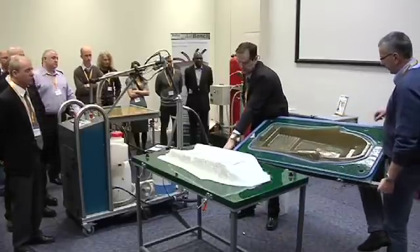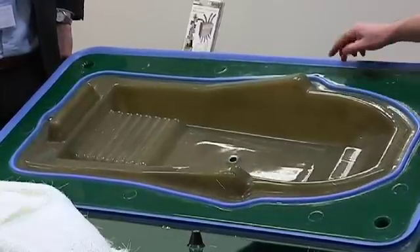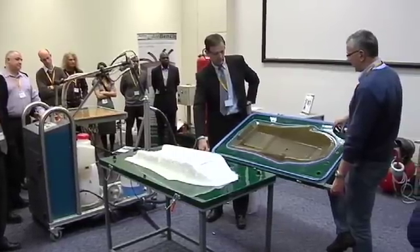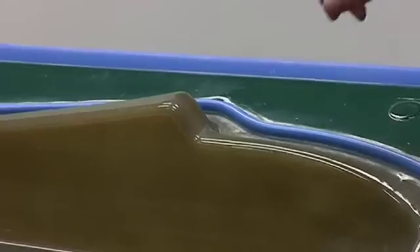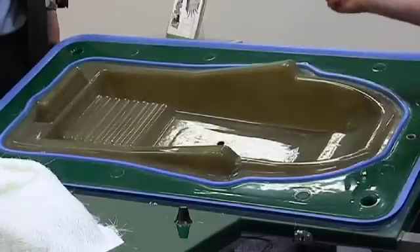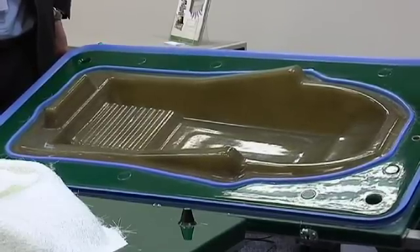On this tool you can see we've got two seals: the outer one is our vacuum seal to prevent air getting into the tool, and the inner one is a resin seal to prevent resin getting out. The gap between them is where we pull as much vacuum as the system has available, and that's our actual clamping force to hold the two halves of the tool together at the correct thickness. We also have a vacuum in the tool surface which improves wet out, helps with the injection, and also helps hold the cavity at the correct thickness.